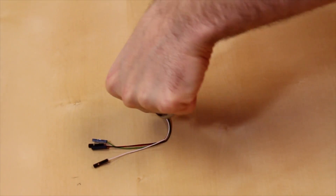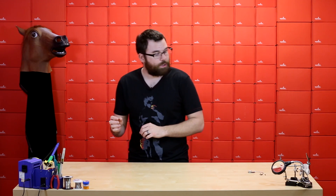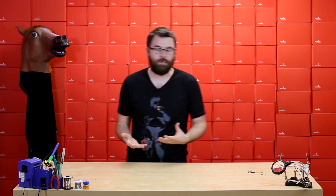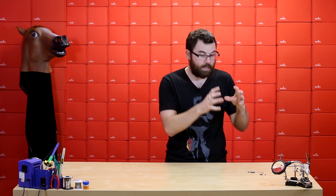You just put your finger down, it takes a picture, saves it. The other nice thing about this is it's all serial communication, so you can transmit that over, save it as a file, do all sorts of different things. You can actually save up to 20 different fingerprints and then propagate those database files out to multiple different fingerprint scanners.